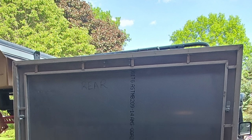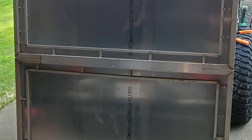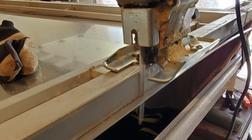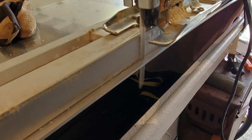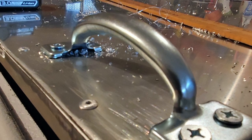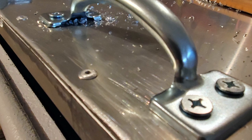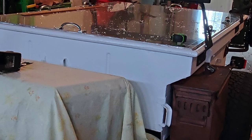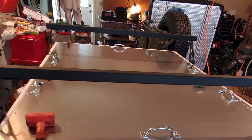Here's a good view of the underside of what it looks like completely put together, with it flipped upside down. Using the frame as a guide, I was able to trim the plate so that it all fit flush. The next step was to attach handles so that I could pull the lid off. I attached six handles, drilled through, and placed bolts in rather than screws so that it won't give way as I pull the lid up. It does fit very snugly.